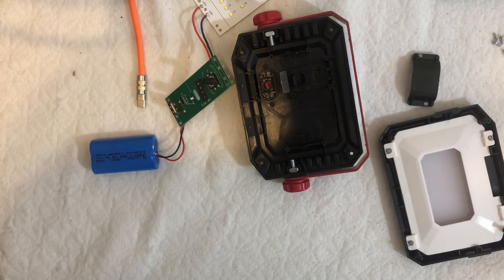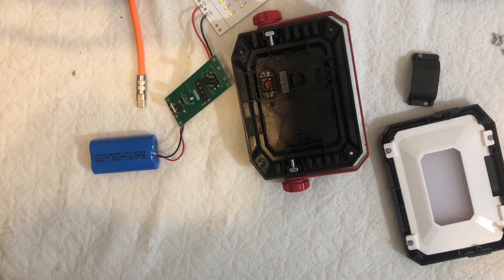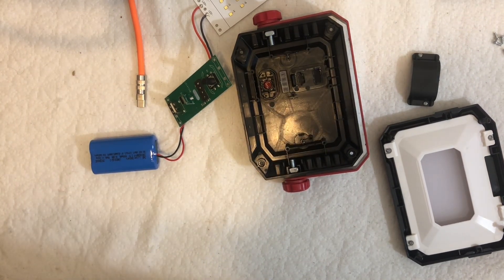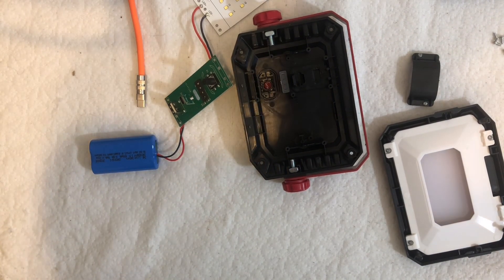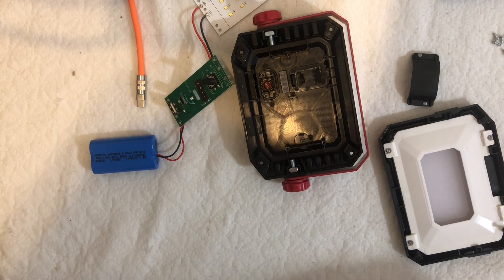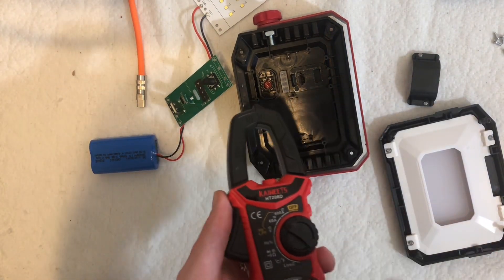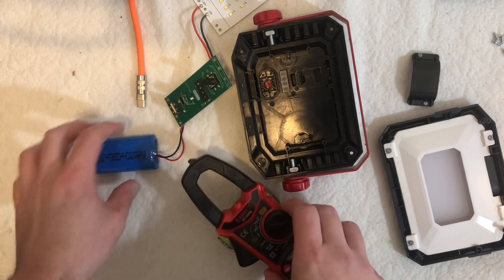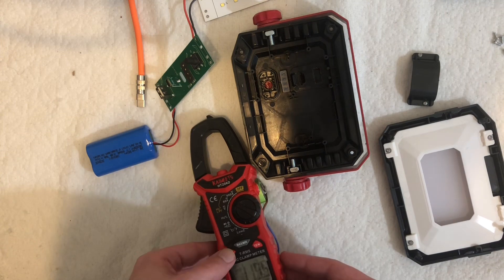Just to show you — we're at 3.663V and 12.8–13 milliohms on my AC IR meter. Good cell, consistent, no complaints other than them being deceptively advertised as new. The light claims to be 1000 lumens. I have a 7000 lumen LED that's 70W, so 10W should equal 1000 lumens if it's linear — I'm not sure if it is. I tested this on my clamp meter; these cells are just about full now after I charged them up.